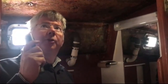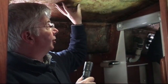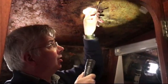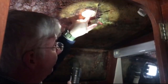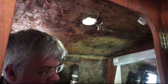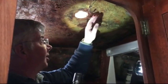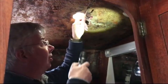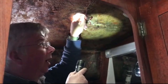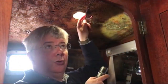The headlining is always a problem on a Westerly — it's called the 'Westerly droop' where the headlining droops down — and this is no exception. I can actually put my fingernail into the balsa core here, which shows the actual thickness of the deck where this vent cover would be. There would be a cowl over it with an electric fan inside for ventilation, and that exposes the deck and shows the balsa core which is three-quarters of an inch thick. That balsa would normally absorb water and go very soft.